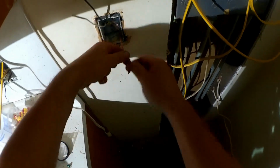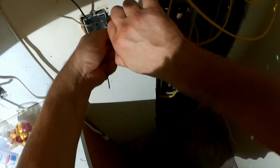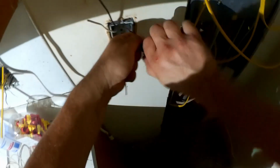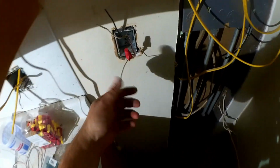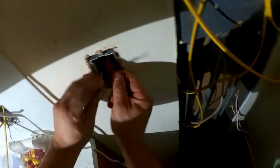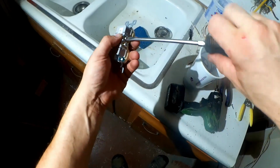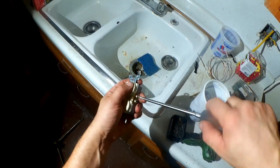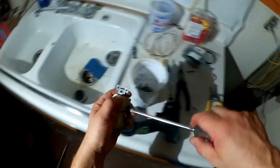We twist those just to help hold them in place while I install the connector. And the connector winds up twisting the wires just how they should be. There's no need to do that beforehand. And that's another thing. People used to just twist the ground wires together. Now we use connectors. And I screw in the unused screws so they're not sticking out, shorting out on things.